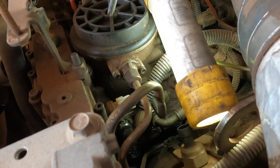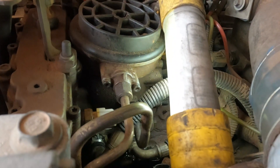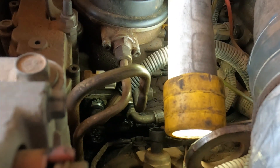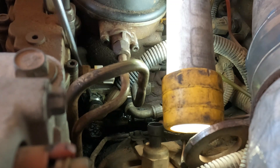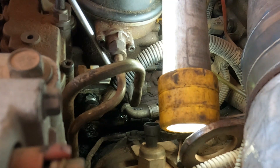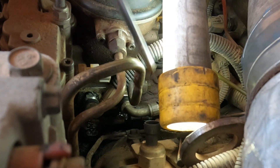I just sprayed this down, and I'm going to try to show you. Follow my little screwdriver - right down here, you can see an O-ring sticking out, and that is the fitting that's leaking. We've got this fitting here as the back one, and then there's another fitting I was pointing to - there's two of them. So we're going to take both of these out. These are high-pressure oil lines that go to each spool in the head.